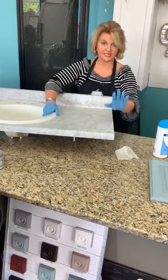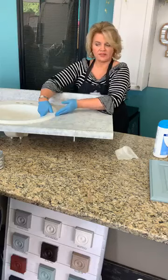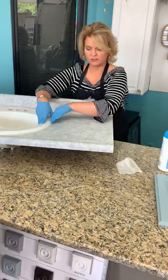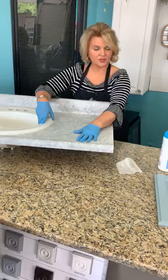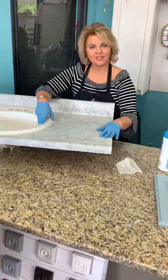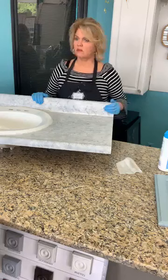The best approach: put down Colosseum as the base coat first. Clean with deglosser — that's the key. Get that oil, grease, and build-up off, especially around the sink where glues and cleaners have settled over time. Remove or tape off the sink, clean well, put down your base coat, then apply other colors with the plastic bag technique. When done, apply the Colosseum base coat back over it to soften it so it doesn't look splotchy. Then lastly, apply antiquing gel in white for additional softening and blending. It sounds laborious but it was pretty quick and a great transformation.